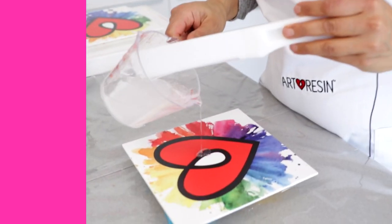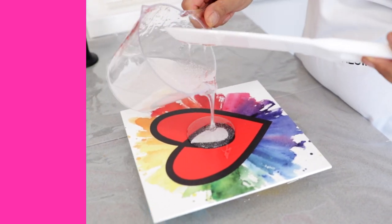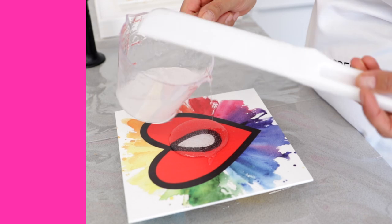What you don't want to do though when you're pouring — you don't want to scrape the sides and bottoms. You just want to pour it right out, not scraping. It's not like a cake batter where you're scraping the mixing bowl as you're pouring. You just want to pour it out, and the reason for that is you may have unmixed resin and hardener stuck to the sides of your mixing container. So if you scrape that out onto your piece, you're going to end up with soft sticky spots of uncatalyzed resin and hardener.